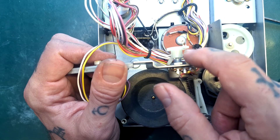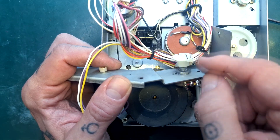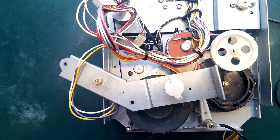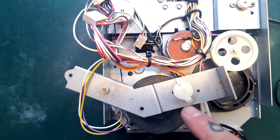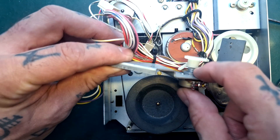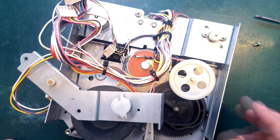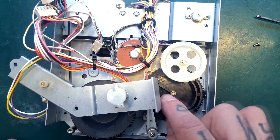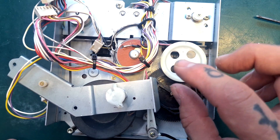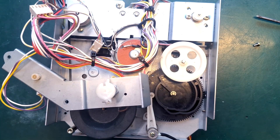The owner sent this unit in for repair — he got so far then sent it to me to finish. He put a bit of metal punched through there, which was working for a bit but it actually bent while I was working on it. What I usually do is get a rotary cutting tool on a Dremel-style drill — I don't actually own a Dremel — and cut two slots in a guitar volume control. A Stratocaster volume control is a good height and gives the correct interface. I have a reel on my Instagram showing a guitar pedal pot used the same way.